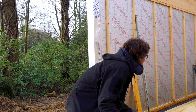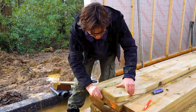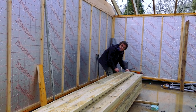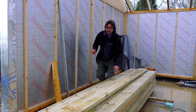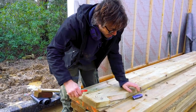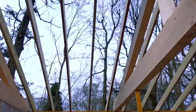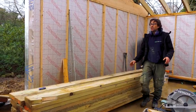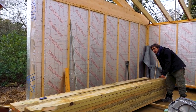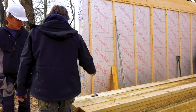It's a little bit fiddly when you're marking out rafters on your own. However, it's all about technique. This particular material has got a good square end — although that's not to be relied on, it's helpful. This timber came via Jewsons. It's not a material supplier I use much, but it was the timber frame company who supplied it. Normally when I'm cutting rafters I like to have a little bit to play with, but there's no waste on these, which works out pretty tight. So I'll drop this template down the front. I've got two circular saws because I hate walking backwards and forwards with one — cut all this end, then I'll cut all that end.